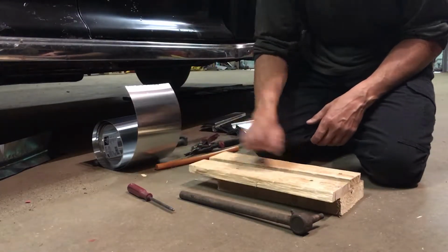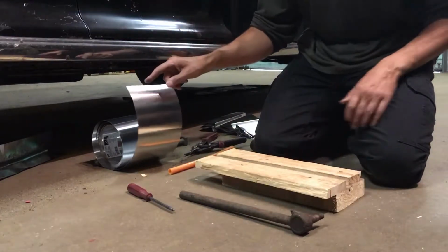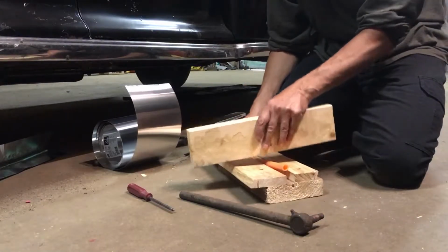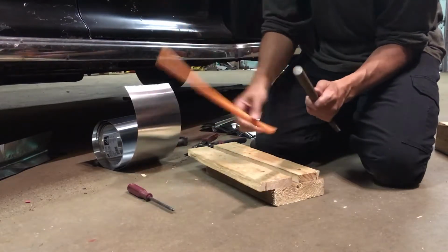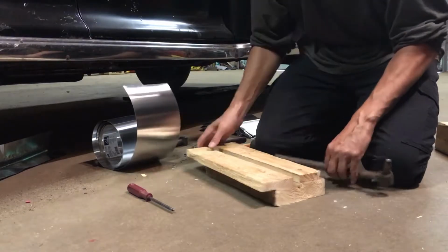The groove is a little bit bigger than the tubing, as you can see, to make up space for the material, as well as the tube has to fit below the surface, because if it's above, it'll rock and then you'll feel it on the floor. You don't want that. So I selected a bar which is a slightly larger diameter than the PEX tubing. You might be able to see it there.